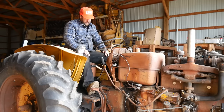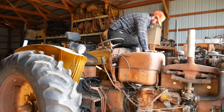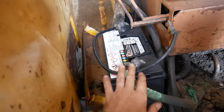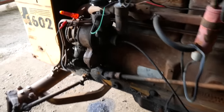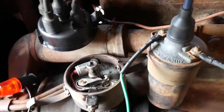I don't think that's enough battery. Oh, no. Is there cables around here? Gotta be. Well, I'm back to the big battery again. I got the battery post adapter on here, and that'll help get them on. Is that loose? It is. Great. Fix that later. And then a guy got to thinking, well, I should just check the old spark down here, and sure enough, I got nothing. I sit here and rock this guy, and I got no spark on them points right there.